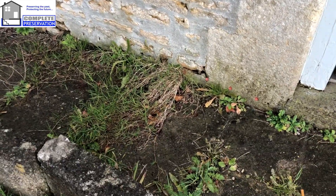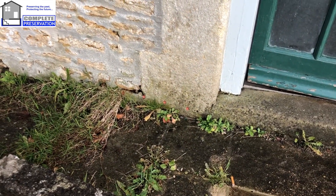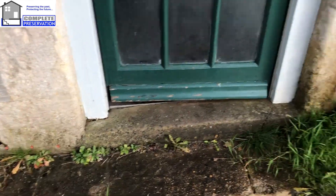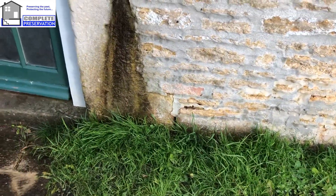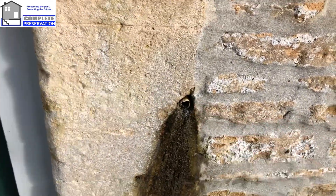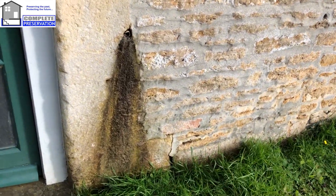This ground, this flooring, looks to be maybe quite original. Looking at the other heights and everything, any sort of form of damp proofing should have been 150mm above the ground, which that clearly isn't. The ground level needs to be dropping about 150mm, which that clearly isn't. So you can see here, we've got six leaks inside, we've got another leak - that's seven. We've got the high ground level - that's eight problems there.